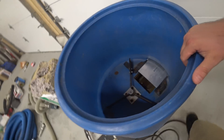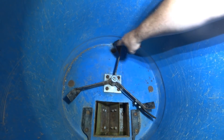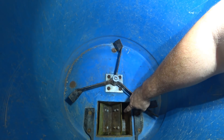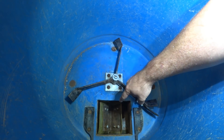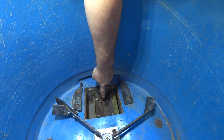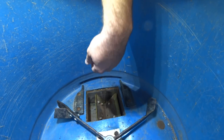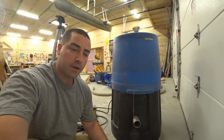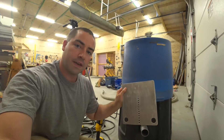Plastic hopper. Now, inside the hopper, this agitator arm is going to spin. It's going to break apart the insulation, and it's going to push it into this lower chamber called the airlock. Now, that is where you need the insulation to go. If this is wide open and all that insulation is falling down there, you can quite often wind up clogging the hose or clogging the airlock. That's just going to slow you down — you're going to need to take it apart and clean it. So, in order to prevent that from clogging up, you're going to close off some of that, and you use a plate like this. This is called the feed gate.